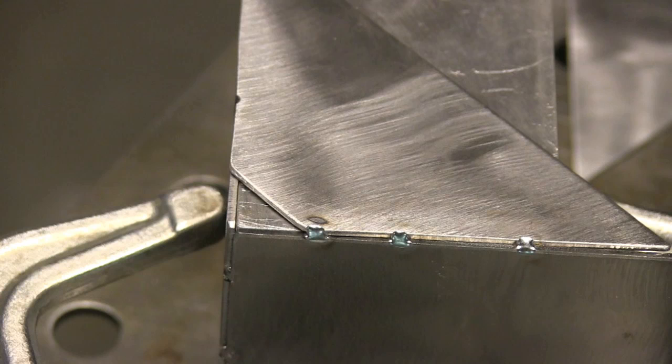It's time to do some welding now. Just for those that don't have pulse on your machine — this is no pulse, no filler. I'm using the foot pedal and using just enough amperage to where the puddle barely wraps the corners. That's fine, nothing wrong with that, works really good.